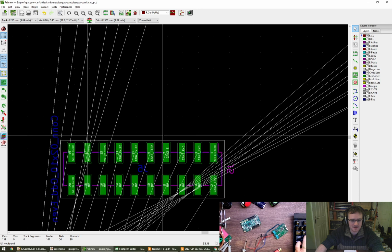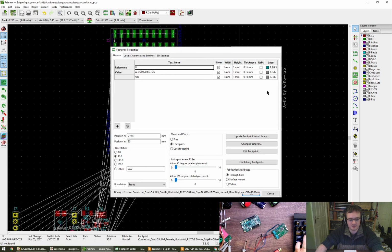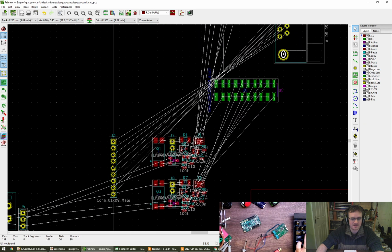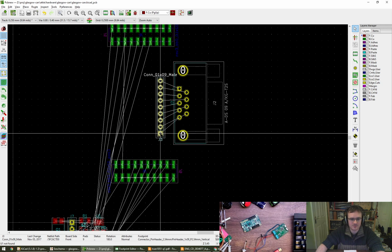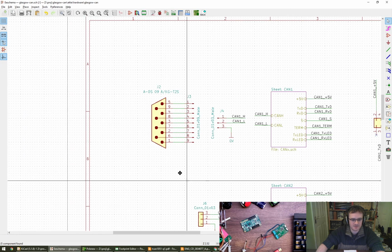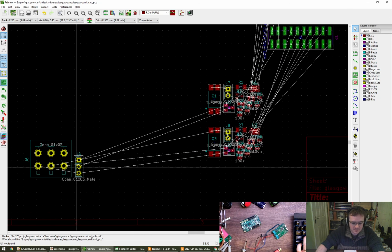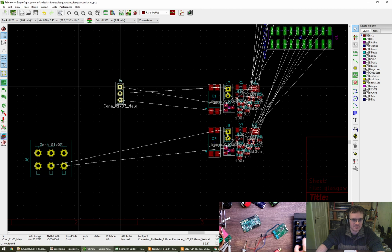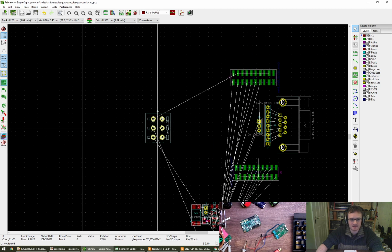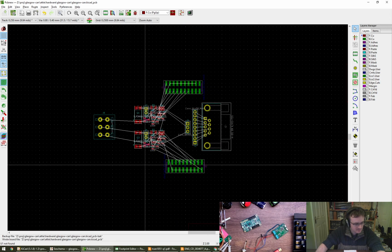So yeah, pin 1 is on the internal right-hand edge. Pin 1 is on the internal left-hand edge. We've got that connector, which I'm kind of expecting will fit between the two, maybe just about. Then we've got all the CAN related stuff. This needs to go sort of there-ish, which I think is okay. Oh, have I got my nets wrong? CAN 2, CAN 1. That's okay. So J4, where's J4 come from? That is J4. It's just in amongst everything else. Oh, okay, all around this looked like it was related. Put that there. This one then, I'm thinking will go over here. And then some CAN stuff will happen there. Look at that. F to flip, cool, thank you.